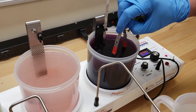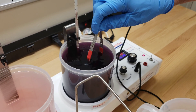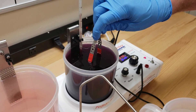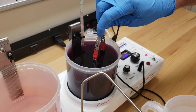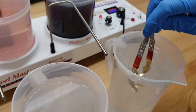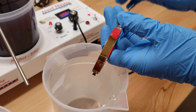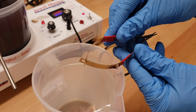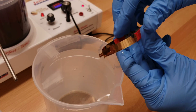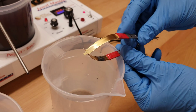For the purposes of this video, I'll keep it short, because if you look, it's already gold — it turns gold nearly instantly. Within 5.5 minutes you'll get a micron of 24K hardened gold, which would be quite thick. These people will probably want to do half a micron or 20 micro inches. So we rinse it, and as you can see, it's a beautiful 24K gold, even inside this little hinge — it's all plated nicely. I'll take the electrical tape off, and this would be a completed instrument.